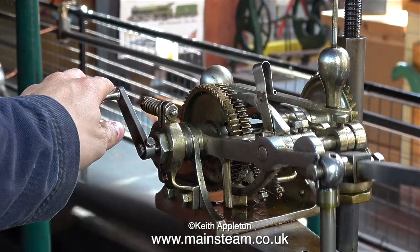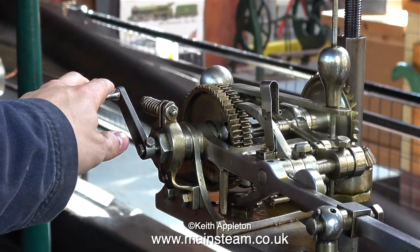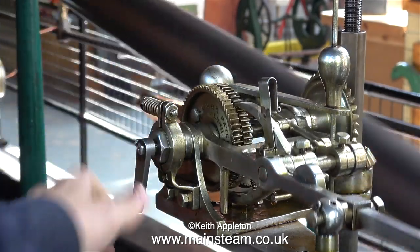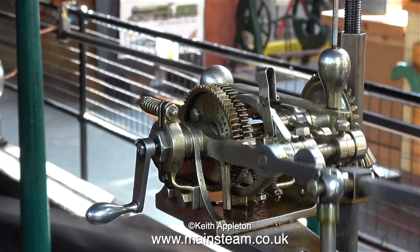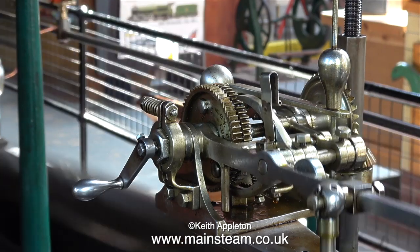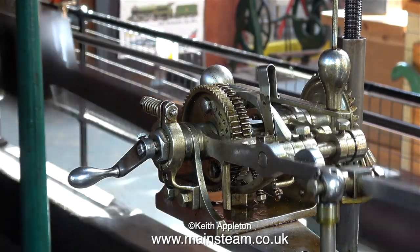Two ratchet wheels, one right hand and one left hand, are on a shaft. The shaft turns a bevel gear, which spins a turnbuckle in the rod going between the governor counterbalance and the engine valve trips, which can make it longer or shorter depending on what direction the turnbuckle is turned.